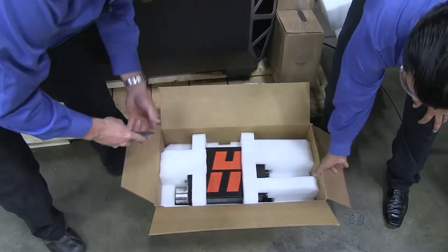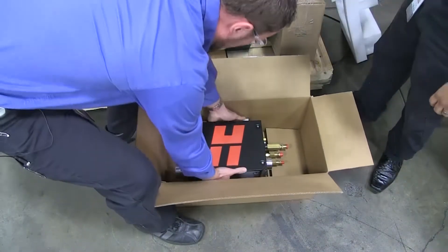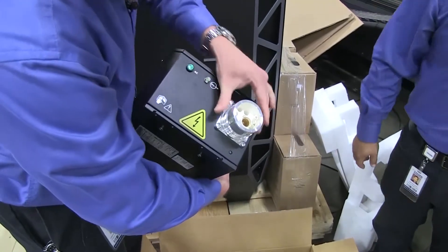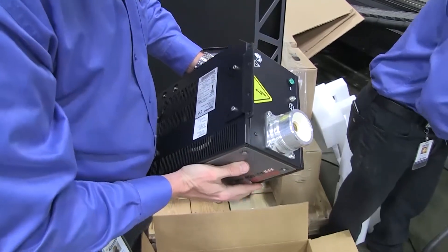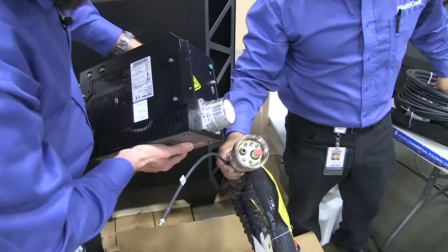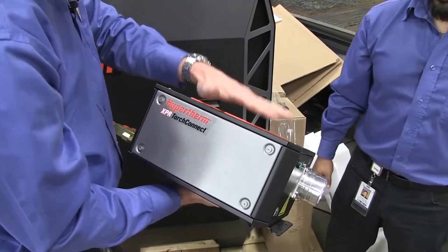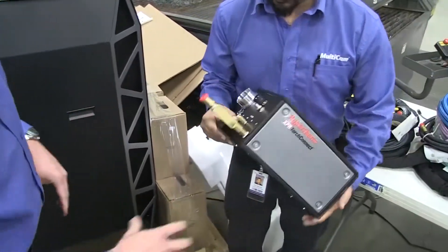That's the torch connect box — the last one was the Optimix, and this is what's going to go right up on our console for connecting the torch to it. Wow, look at that connector — huge. So that's what's going to connect to that torch lead we had. This is going to mount right up on our bridge and shortens that distance from where the torch is communicating and sending gas signals straight out to the torch.